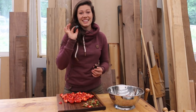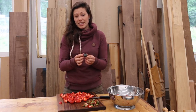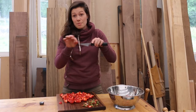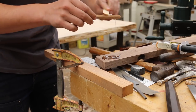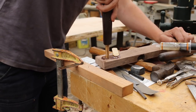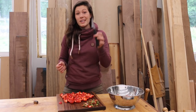So I mentioned at the beginning of this video that we started with this billet. A billet is literally just a blank — a piece of steel. This was a pattern-welded piece of 1084 and 15N20 steel, which was folded and drawn out, folded and drawn out, until it had 150 layers. That's what makes this pattern. The pattern is basically invisible until you place it into some kind of acid, and the acid makes that pattern visible. You'll see that whole process happen in the video. That was a really fascinating thing to figure out — how Damascus is made and how you can turn something that's just been squished and stretched and squished and stretched into something that looks so dang cool.